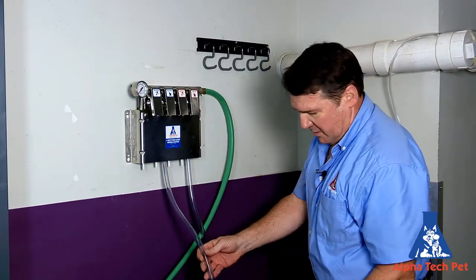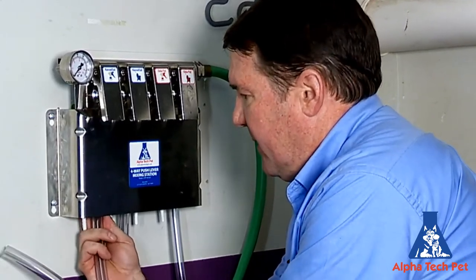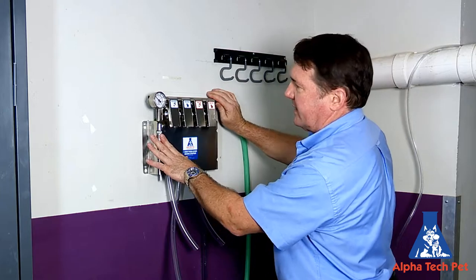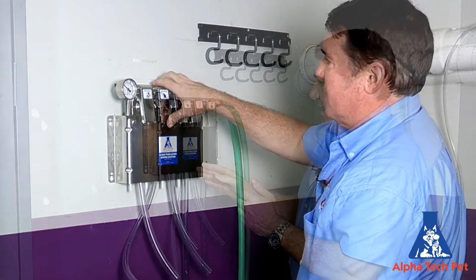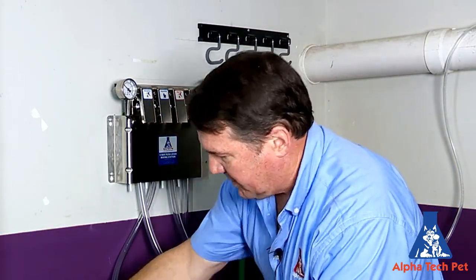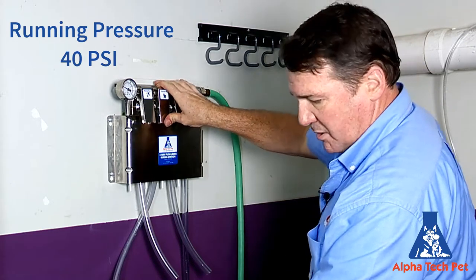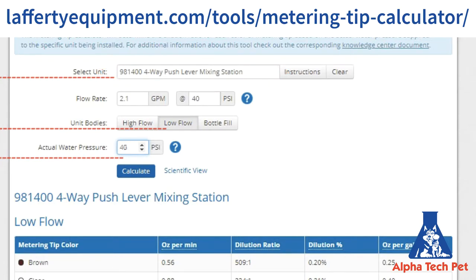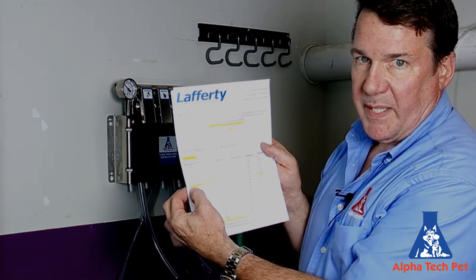Now that we have our hoses here — this one for the mop bucket goes right down to the ground, and the shorter ones are for your spray bottles — just stick it right up into the connection and push it on; it slides in, stops, and there you go. We're reading the static pressure at about 58 psi, but you don't want to use that to determine your pin. Push the button so water flows, and now the actual running pressure is 40 psi. This unit is a 981-400, a four-way push lever mixing station. At 40 psi, the chart tells us we'll go with 2.32 ounces per gallon, which is the dark green pin.